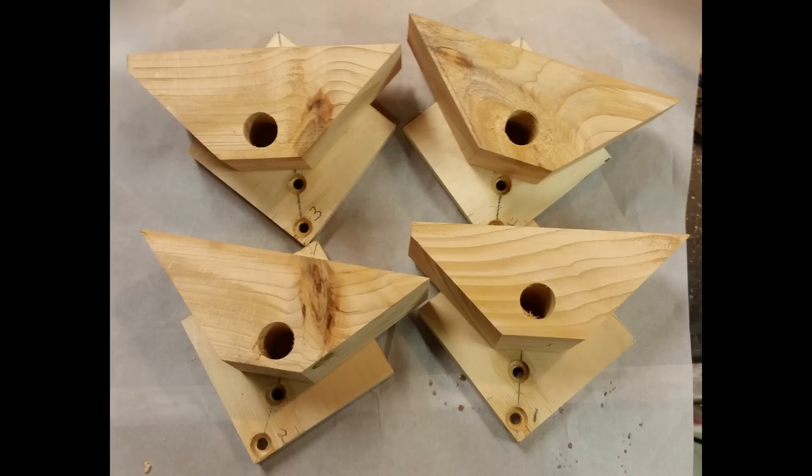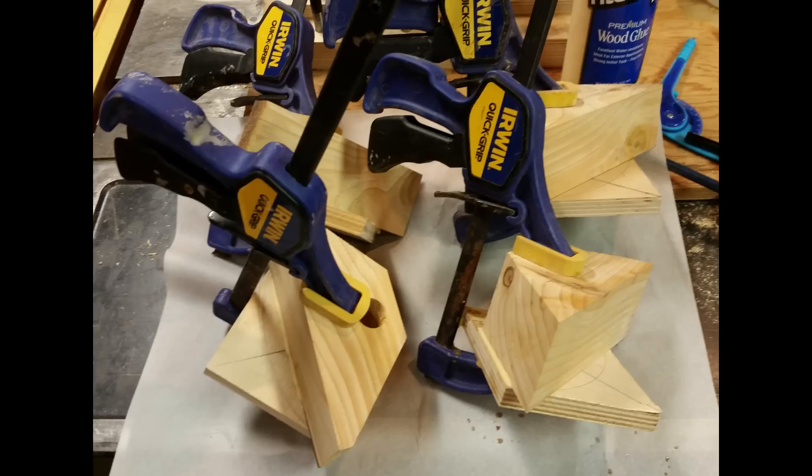Then I cut 4 pieces of 2 inch thick wood for my jaws with ends mitered similar to a picture frame. I also marked and drilled access holes for the outer bolt hole — I would not trust the jaws with only one bolt per jaw. Then glued each block to the plywood face. Allow them to harden overnight.